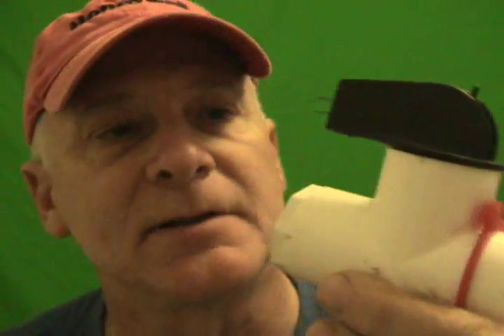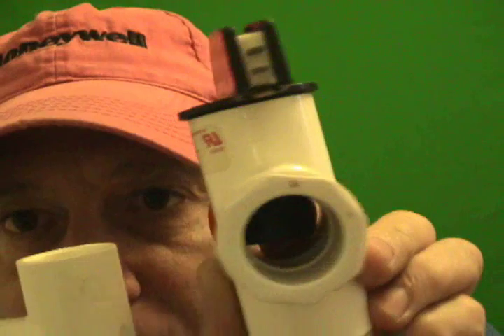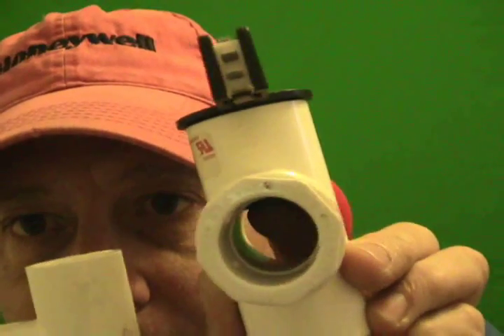What this is meant to do is you could have an alarm set up, or a light or something like that, to let you know that your condensate drain is clogged up. The way this thing works is really very simple — the water would push the float up, and the normally open position closes and the normally closed position opens. Simple as that.